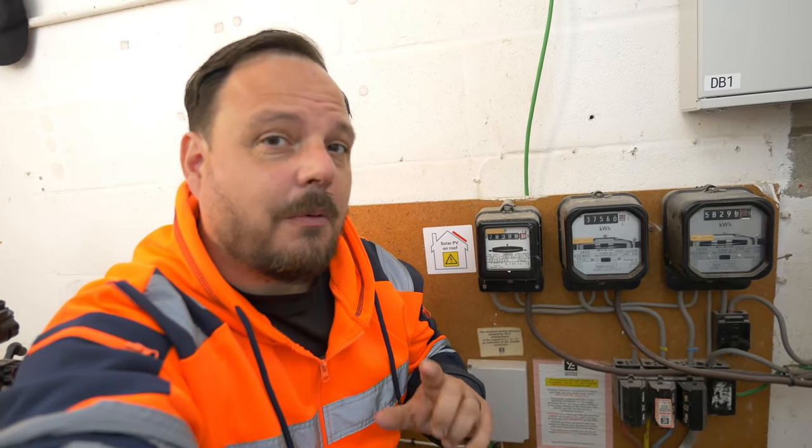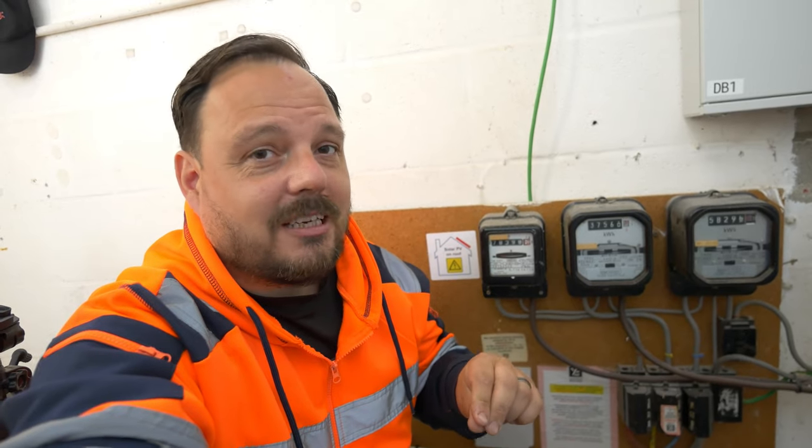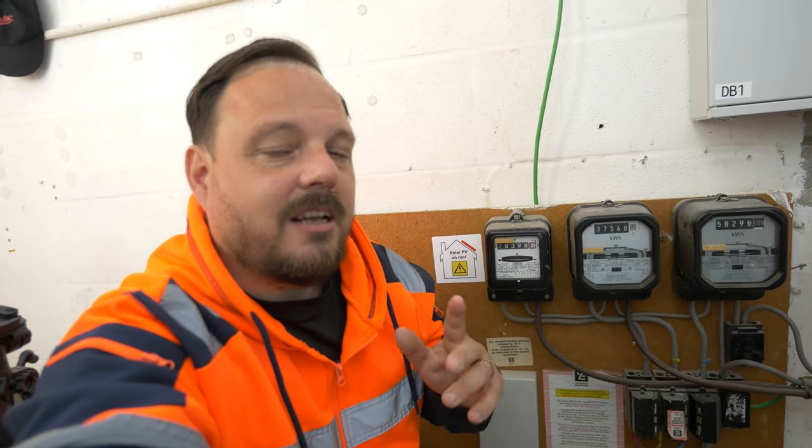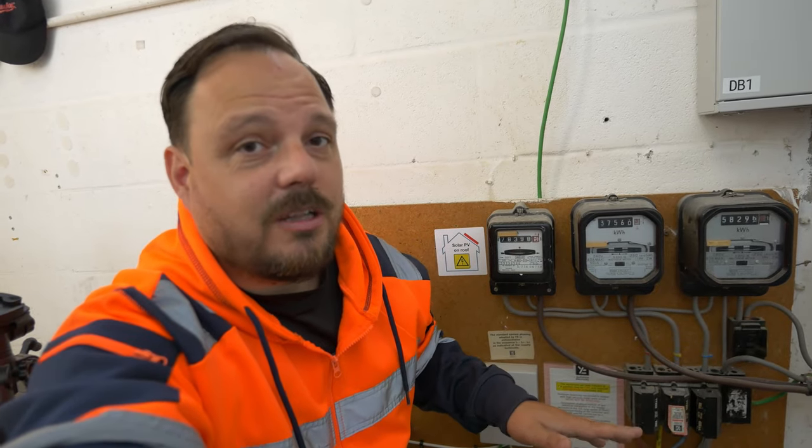Before I get into all of that, I want to point you at the excellent video that JW, aka John Ward, has put out last week, really explaining in fine detail through his excellent demonstration board the dangers that can present when the neutral in a TNCS supply arrangement goes down. I'm going to set it out here with a real world example of a service head that is currently exposed, and we can run through some checks for circulating currents and things we can do to mitigate them whilst working on deconstructed electrical systems.